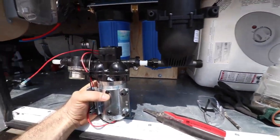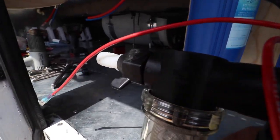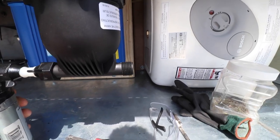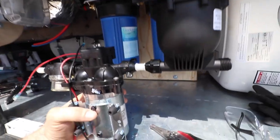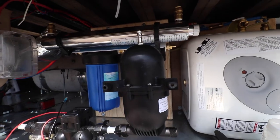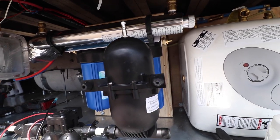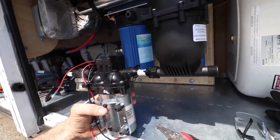right behind the wall so that the fresh water can come in from the tank on this side, because the tank's gonna be off in the back in between the chassis, and then the pump can take the water through the accumulator tank here. Even though the accumulator tank doesn't need to be in line, it just needs to be in a T. This is the best orientation for us. And the accumulator tank instruction says to put the threaded nipple towards the sky if possible. It's the best orientation for winterizing, so I might as well do that as well.